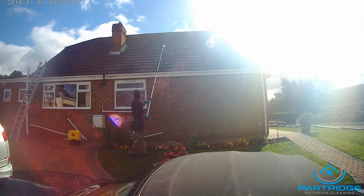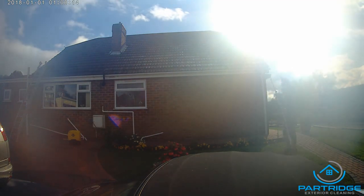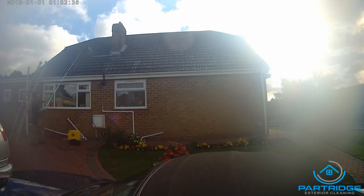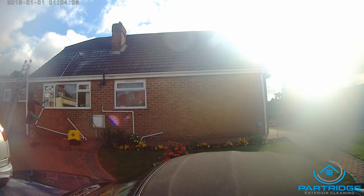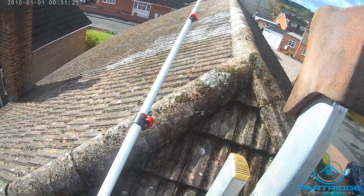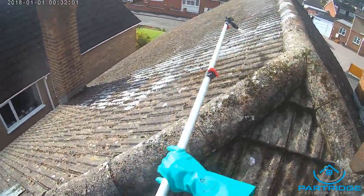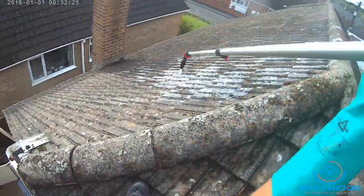What the biocide will do over the coming months is break down all of the organic matter left on the roof — the bits of algae and moss stuck in gaps that you just can't get to with a scraper or even by hand. It'll start to kill that off slowly but surely. They say to expect full results within around 18 months, but you can start to see decent results from six months. It depends on your location, the state of the roof, and how damp it is — a really damp roof may take longer, but as long as the biocide has had a chance to soak in, it's going to be completely fine.